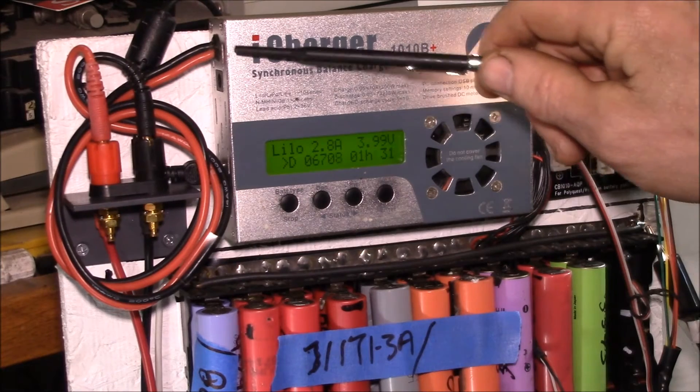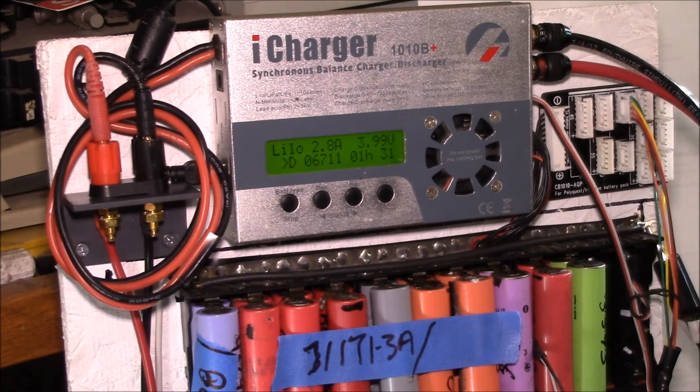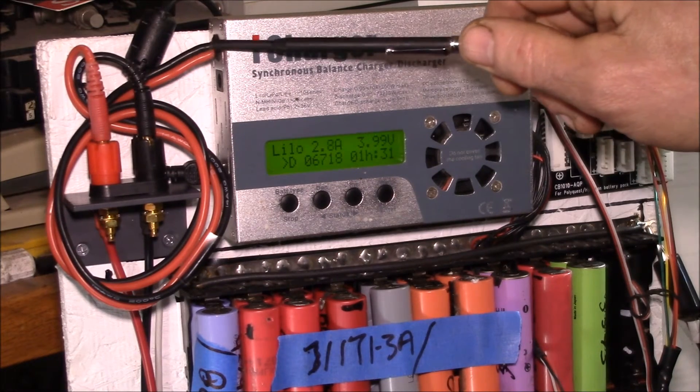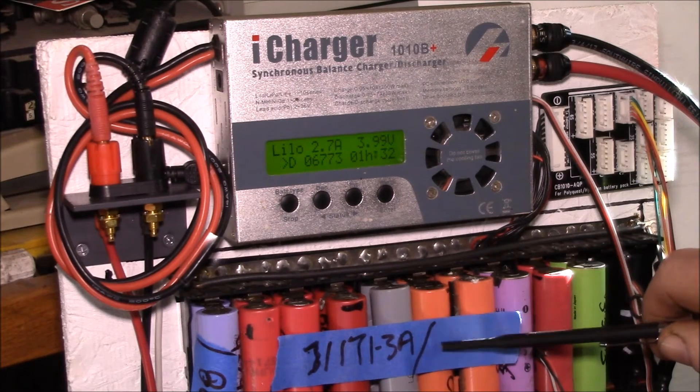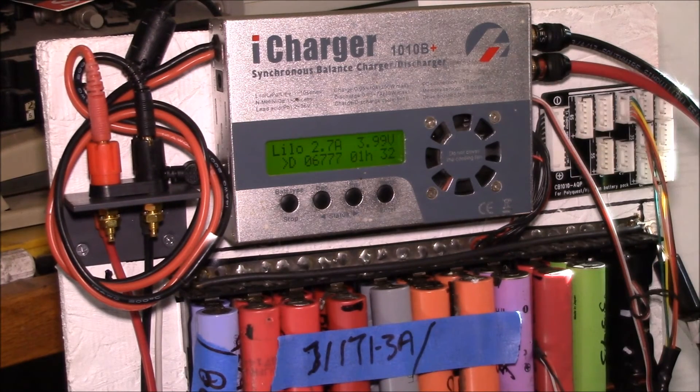What I found is a 3 amp discharge with the regenerative function would just about equal my overnight load on the 12 volt battery bank, so I could discharge out of this charger and power my overnight loads, which in the winter aren't quite as heavy — I don't have the attic fans running, for example. I also found I could set up a 4S pack with a 3 amp discharge that was able to take my solar battery bank from about 90 percent state of charge — so on a cloudy day I could dump 30 amp hours of lithium batteries into my 200 amp hour lead acid bank to charge it up if it was discharged. It was a bit limiting because you could only do that if the battery bank didn't get fully charged during the day.